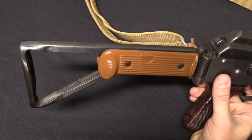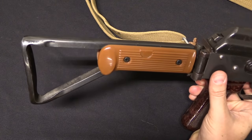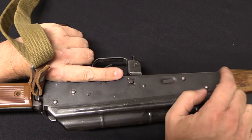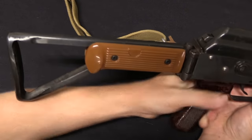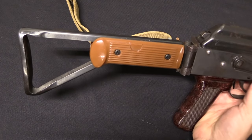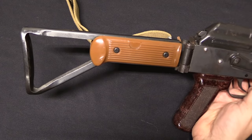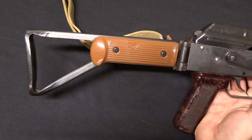The fancy best option at the time was the Russian or Bulgarian triangular side folder. However, I was lazy and wanted to make this as simple a build as possible. Those triangle side folders require you to cut a notch and rivet in place the catch to hold the side folder open, and I didn't want to deal with that. I hadn't ever built one of those, and I didn't want to start with this gun. So that left me with only one option: the Chinese Type 56 side folding stock. At that time I found one for like $650 for the trunnion and rear stock, which was insanely expensive - that would have cost more than the entire rest of the gun, including the tax stamp.